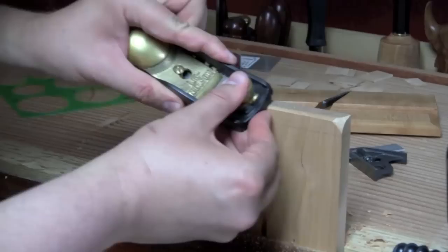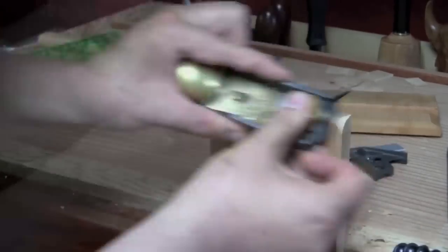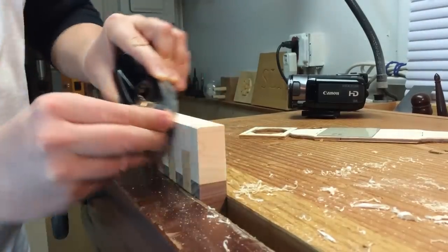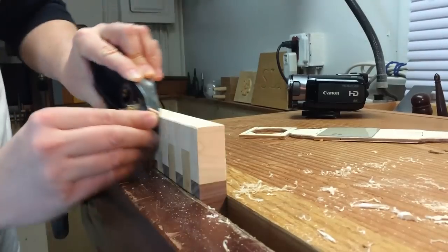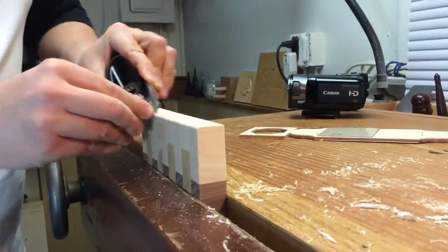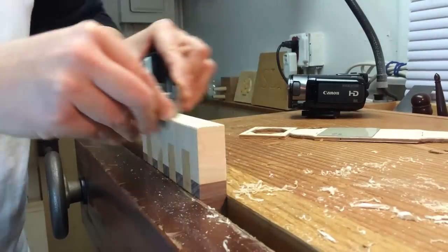For just small block plane work, it's outstanding. Again, getting the work up close to your face, the block plane handles that delicate stuff, then you don't really need leverage of a lower bench position. You can break edges with the block plane very quickly, and it's a very common task, and the vise will hold everything right where you want it.